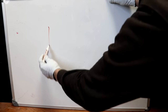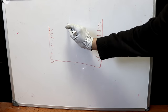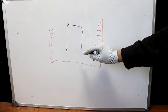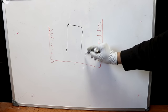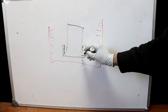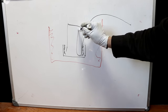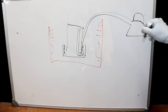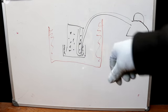What I'm thinking is I'll have my electric furnace here and put the charcoal inside of a stainless steel flask. It's got to be stainless steel because the superheated steam will burn iron if it's unalloyed. Have a little dish at the bottom, maybe fill it with charcoal to keep the air out, and then have a stainless steel tube come in and go up to the top. Then maybe have a tea kettle over here to produce the steam, and this will be filled with my crushed charcoal. Let's build it.